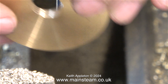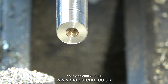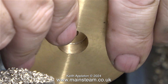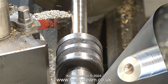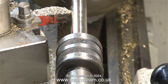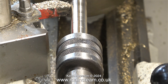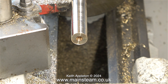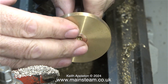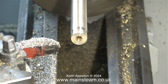All the better to grip the silver solder. I try the firebox end in place and it's a perfect fit, but I need to extend the reduced diameter so it's level with the end of the firebox plate. To be honest, the holes in the cap and the firebox plate are not exactly the same — this was a mistake when I machined them, and I will machine each end to fit the individual plate. The main diameter of the entire centre flue is not the same as the holes in the plates. Each of the ends are turned slightly undersized to fit in the plates, and the reason for not turning it all away is I don't want the plate to slide down the flue when I'm silver soldering it.